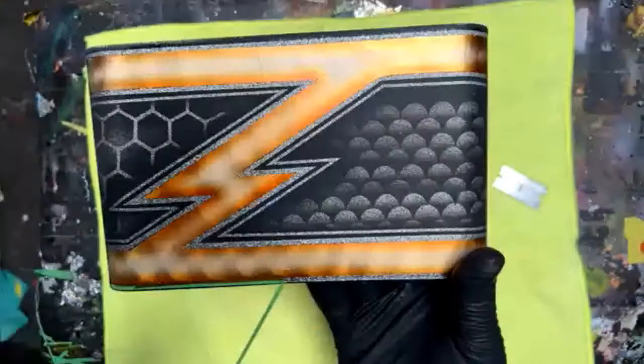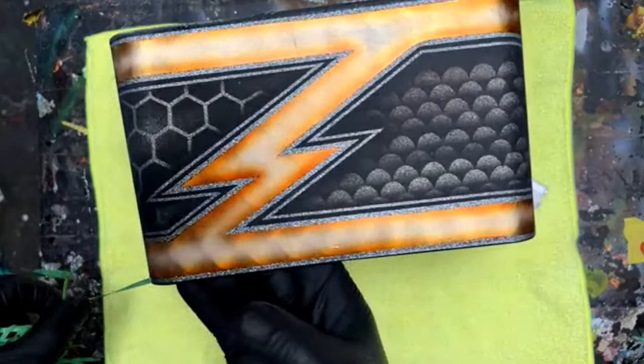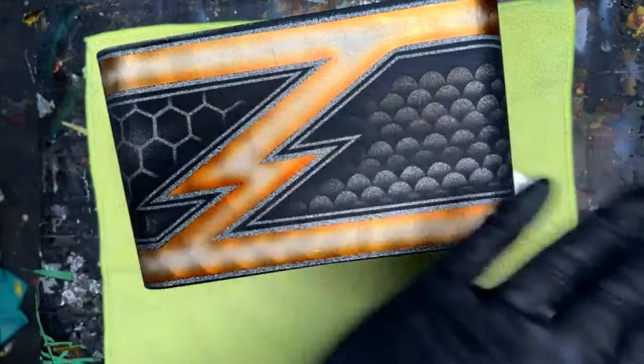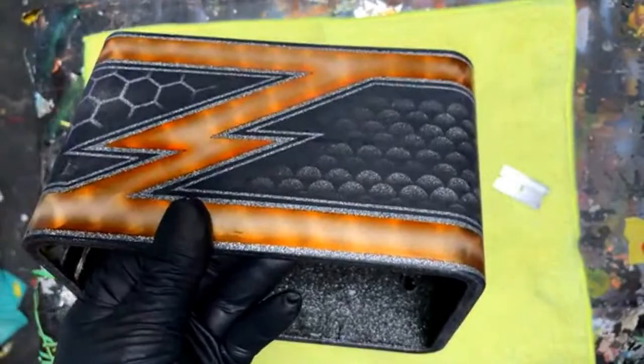After those 4 coats or so, you would just let it dry and then sand it smooth, not sand through. You have enough clear on there to sand it smooth. And then you just move on from there. So basically we're layering it up. After this, I'm going to throw it back into clear coat and probably fix the errors after that, because this piece is so small and I'm not in a hurry to really have it done.